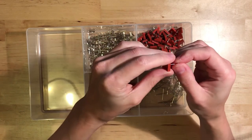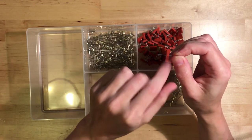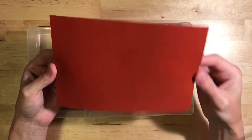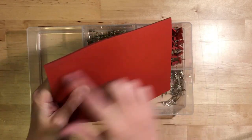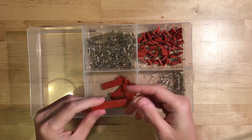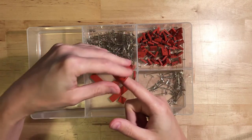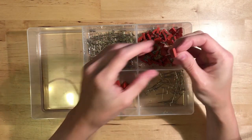So I found this online, and somebody showed this method. These are actually silicone pads, and this is what that looks like by itself. I just bought a 12 inch by 12 inch, or maybe 8 inch by 8 inch, I can't remember, sheet of silicone, and that's 1/8 inch. And then I just cut it with a razor blade to the sizes that I needed, and got a few strips like this for if I needed to push two sides in, and then I could have my piece in here. It would help with keeping it straight. And then also this size.